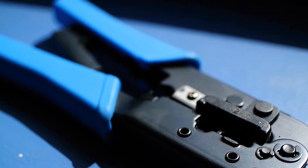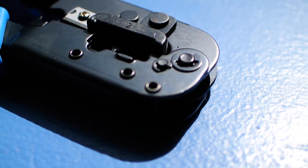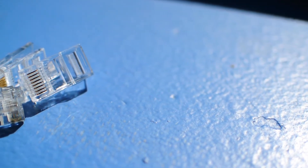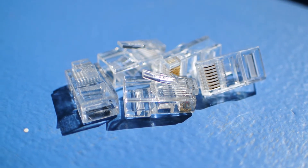Let's take a look at the tools you'll need — there are only a few. The first is a network cable crimper, which has a die used to crimp the ends onto the cable, plus a built-in section to strip the sheathing off the outside. These can be expensive for a really nice one, but a basic one is pretty cheap, anywhere between $10 and $20. You'll also need a nice pair of scissors — don't use your significant other's sewing scissors, because they'll get dull. If you're working with CAT6, a pair of diagonal cutters will come in very handy, though you don't need them for CAT5e. The only supply beyond the cable stock is an RJ45 connector — you can buy these in a bag of 100 for just a few bucks. I like the all-in-one type; the multi-piece kinds are harder to work with and less reliable.